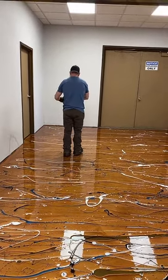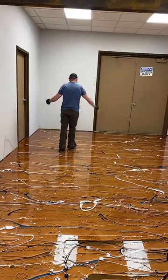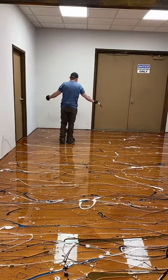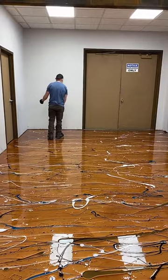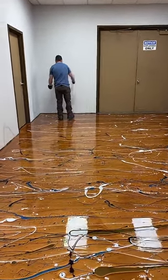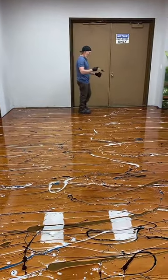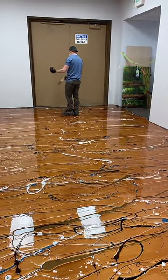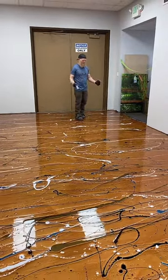Can you do shower floors? Yes — this is an amazing product for it. Come to a class and you do shower floors. For masking, the easiest way is to remove the masking tape before the product fully sets. You can also use a really tough wire filament tape and go back in early the next day — don't let it overly cure but give yourself about 10 to 12 hours, and then peel it.